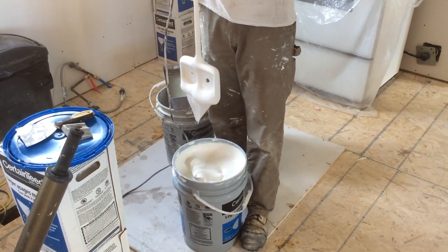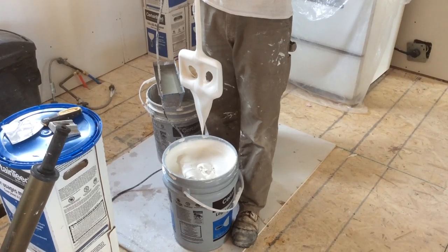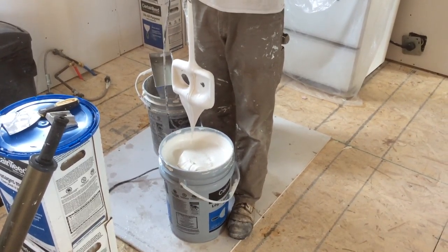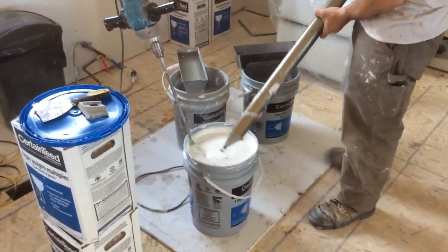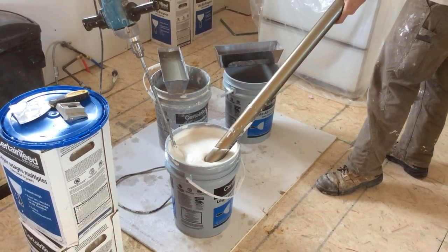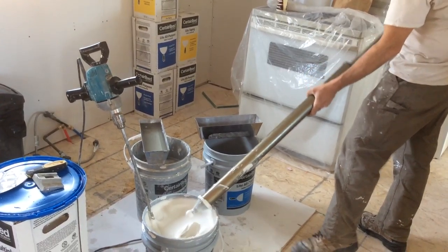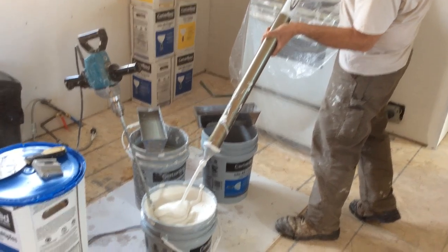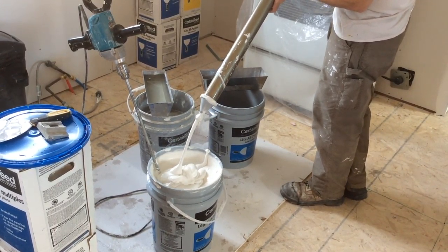After about half a pan of water, that's still pretty thick on the blade — still pretty meaty. When I pull it out, I don't want it to be that meaty, so it's going to need a little more water. I'll show you by pulling it up in the tube as well. It's a little stiffer, harder to pull up. It should only take about five seconds to fill your tube. You can see I'm pushing pretty hard to get it out — it looks pretty wet but it's really not wet enough.